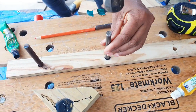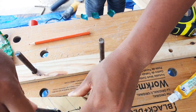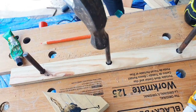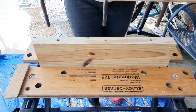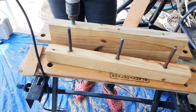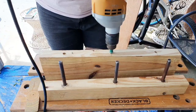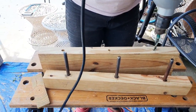Also, you do not have to use steel dowels — you can use wooden, acrylic, or any other form of dowels. Now I'm inserting the back portion into the front portion and I realize that some of the holes are a bit tight, so I'm just using the drill to make some more passes through the holes, not too much because I want the dowels to be inserted tightly.